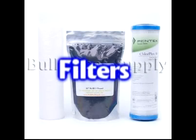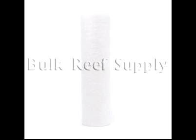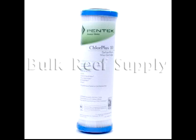Because chloramines and ammonia are so dangerous to the aquarium it is absolutely critical that we maintain the filters properly. The first filter is a sediment filter which will take out most of the large particles — this should be changed when it appears brown and dirty or when you notice a drop in pressure indicating it is clogged. The next two filters are the catalytic carbon and the chlor-plus carbon block. When used in conjunction like this, we recommend changing them both out every 4000 gallons — keep in mind this is both waste water and product water combined, so at a typical 3-to-1 ratio this means a filter change after producing 1000 gallons of product water.